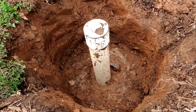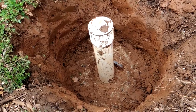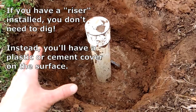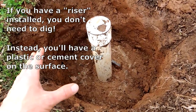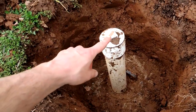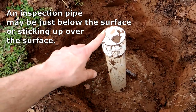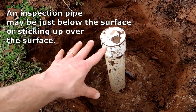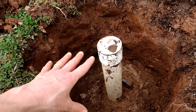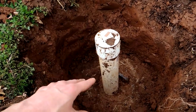What we're looking at here is a fairly modern septic tank. If your tank was installed in the last 20 years or so, it's probably something like this, but there are definitely variations. Typically you're going to have an inspection pipe — you can take the top off and look down that pipe to see what's in there. This pipe is usually a 4-inch PVC, typically just above the ground but may be just below. This pipe is fine for looking in, but you can't really pump from it.